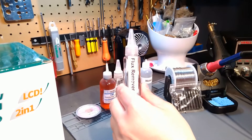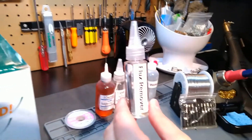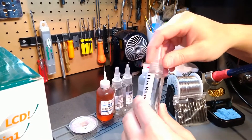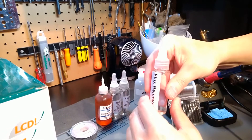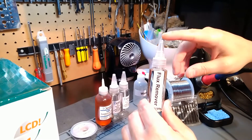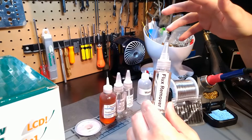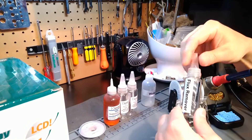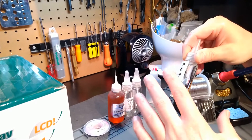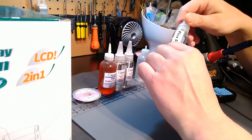Flux remover — I cannot tell you guys, even though we're using RMA flux, if you ever get the flux on anything, you'll be very, very appreciative that this is included. Flux remover is very expensive. If you're doing rework-type stuff, it's a must. This flux remover comes 1.2 ounces in a hard plastic bottle with a screw-on removable cap. What I love about the dispensing using a bottle is, number one, it's precision — you're not spraying your whole shop with an aerosol and losing 60 to 65% of your product. Using one to two drops, it allows you to precisely put the flux remover where you need it. When you use the Kester product, you'll get that beautiful chrome finish you're looking for.